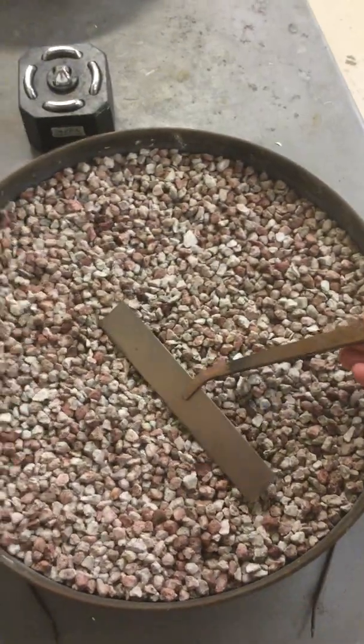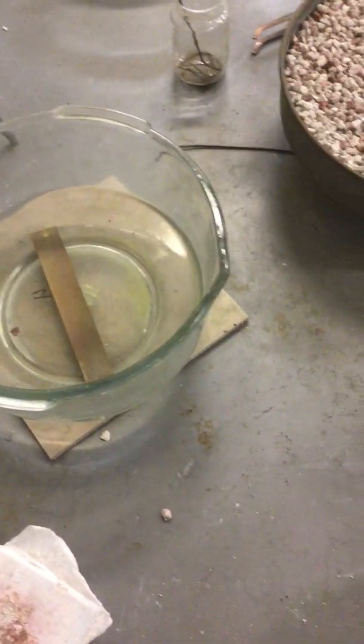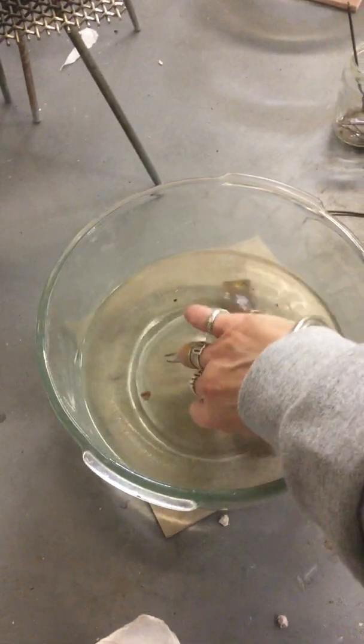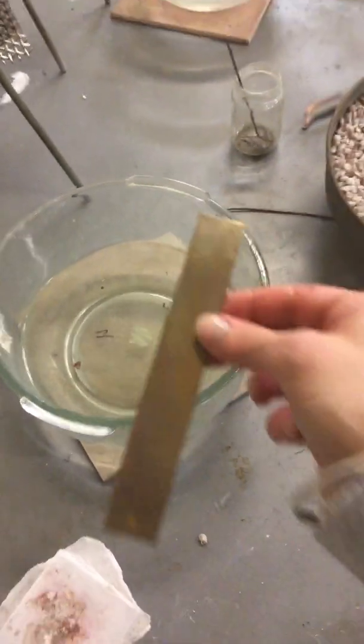I'm also not going to touch that piece of metal because that's very hot too. So I'm going to use these tongs here, and I have this quench bowl. This is water, and I immediately can quench it. As soon as you quench it, it is now cool to the touch. So then you bring it over to the pickle. In our room, we have a very bad design because the pickle is all the way across the room, so we have to walk our dripping piece of metal all the way around.